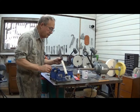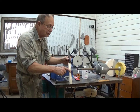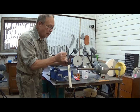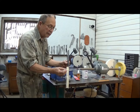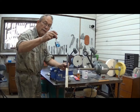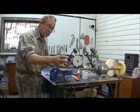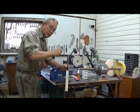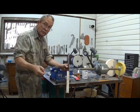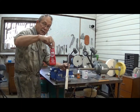There was another issue with this knife in that this section right here — the steel tang did not come all the way back to the wood. So there is a triangular gap here. Rather than fill all of that with adhesive, I have cut a wedge to fit. That is going to be glued in here with a very rapid-setting glue. Then the pommel will need to be attached, which is this block of drilled wood, and the hole is to fit this screw eye, which will be set in with the familiar Shoe Goo.